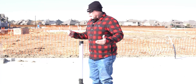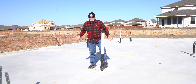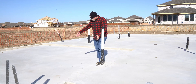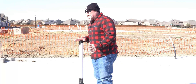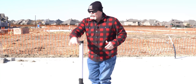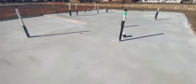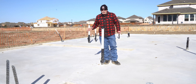Now I'm in the garage, now I'm in the front entryway. There's nothing here unless they're going to put a mop sink out in the garage, but as narrow and shallow as these garages are, I don't think they want a big mop sink taking up car space. What I've seen them do is come up, 90 this out, make this a clean-out, so if the main is ever stopped up in the front of the house, the plumber could step into the garage, run a machine through here, and clean everything out. This first line is probably just a clean-out to go into the garage.